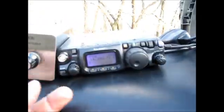I'm going to have to go into the function settings here and change the squelch setting, because now I'm running HF. And then I've got to set this so it's looking at the back antenna port, rear. So that's good. Now I crank that up. And now we're hearing HF stations on 14 megahertz. This is the band that you can start hearing around the world.